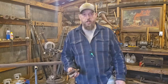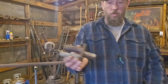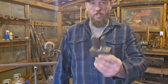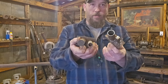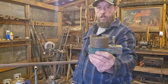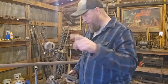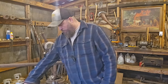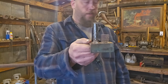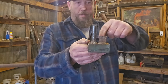There are two different ways you can make them — at least for me. Ones I've made to go in my hardy hole with a square shank, and ones I use with a piece of angle iron in the vise. Both of these are for making hooks. This bigger one is made for the tripods I make, to form the big eye on one leg. This one here — you can see where the size steps down shorter — I use for swing arm cookers.